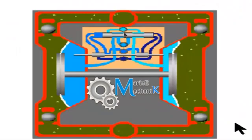So we have the engine room control air supply, which is usually 7 bar, coming to the air supply manifold or air distribution valve unit, which is indicated in orange color. And after that, you have to notice, whenever you go on board, there are two lines. One is the main air, which operates the diaphragm, and the other is the pilot air. Both are 7 bar, but that's called pilot air. I call it pilot air just for easy understanding. Since we know the air starting of the main engine or generator has main air and pilot air, similarly the main air is the one which operates the diaphragm, and the pilot air is the one which operates this spool valve, or you can even call it a pilot valve.